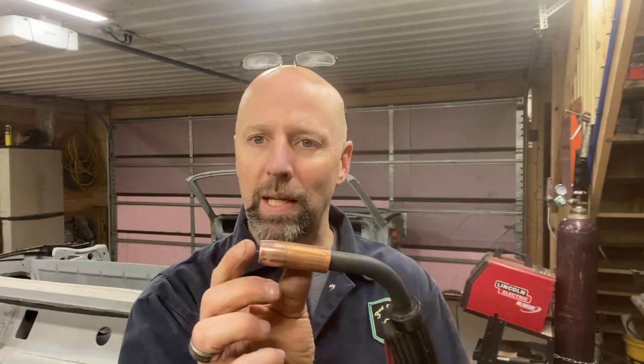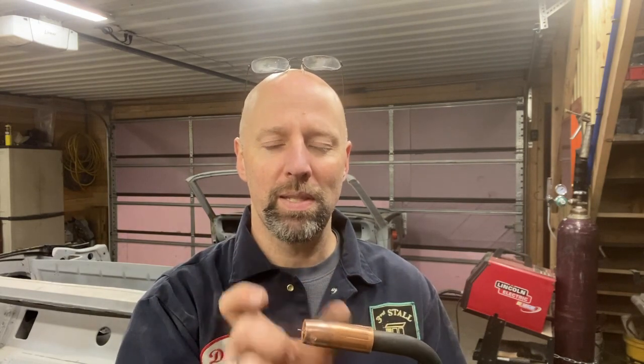And there's 2 reasons for that, or maybe more, I don't know. One is that way you've got a consistent distance. The more consistent you have set up, the more control you have, the better you'll be able to do. The second one is that it gives a nice raw, fresh edge to that wire, so you'll get a good consistent spark.